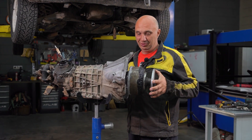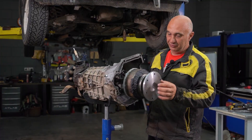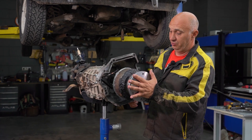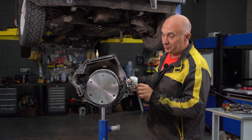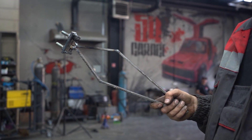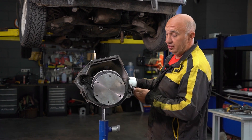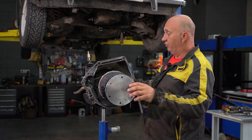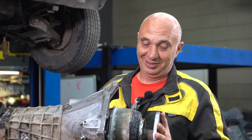Check out what we got here. Here we have the clutch assembly attached to the gearbox. We got everything assembled and it looks about as we'd imagined. This side will be connected to the flywheel. Here we have the clutch itself, and here we have the release mechanism — that's an interesting one. We've cooked up this fork, pieced together out of metal strips. It's turned out fairly light, and its purpose is to release the clutch and disengage the clutch packs to allow the transmission to change gear. Let's fit this gearbox to a car and get to the testing phase.